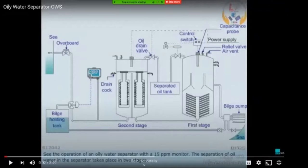The smaller particles inside, which grow in size, tend to come out and usually flow to the top of the chamber, where they get accumulated here. So this basically separates the maximum oily water emulsion from the first stage. Whatever smaller fractions or leftover oily particle substances are still present then pass here through this direction, and they are pumped into the water separator.